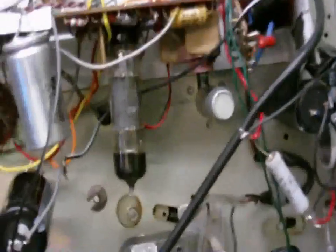So this is my solution to stop it. I'm going to connect everything to a single ground — I'm even going to connect the earths on the two sockets together. I'm not going to take the two sockets apart obviously, but I will connect the earths on them together. Now starting from this tape recorder here, which I pretty much tidied up the electronics inside. You can see there's a wire coming off the ground on it. I'll just get some of these cables out of the way so I can show them.